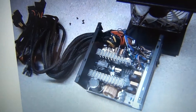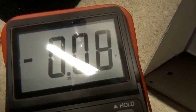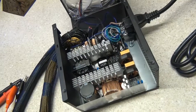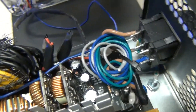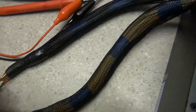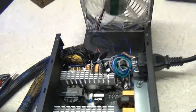This is what you're going to get when you open one of these power supplies up — there's a lot of stuff in there. You're going to connect either the gray and the green, or the blue and the green. On this one it was the blue and the green to make the power supply stay on, where I could read a continuous 12 volts on my voltage meter. You can see my green and blue wire connected together, coiled up and tied on the side. All the other wires I removed are covered with black electrical tape, and you can clearly see the yellow and the black leads all connected together.